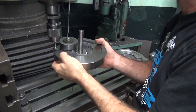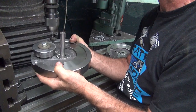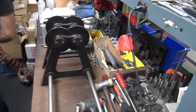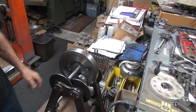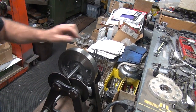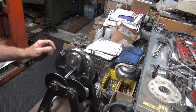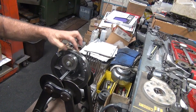To start, we're doing deburr because I don't like sharp edges. Okay, so maximum effect is dead center. But we don't want to drill right here because it weakens the flywheel, it can crack through there. So you want to drill off the sides. The further away you get from the center point, the less effect that weight does. It takes weight out of the flywheel, but doesn't take weight for the balancing.